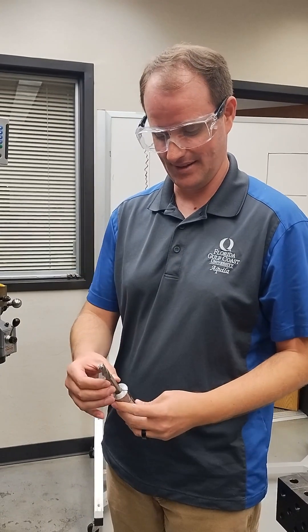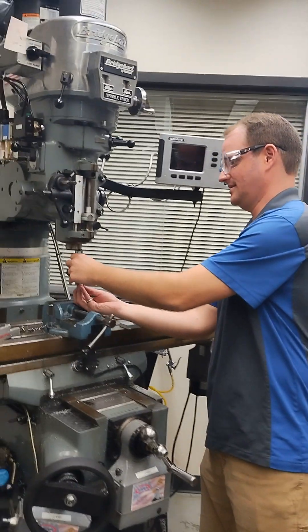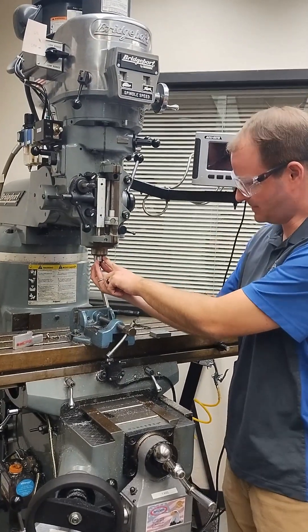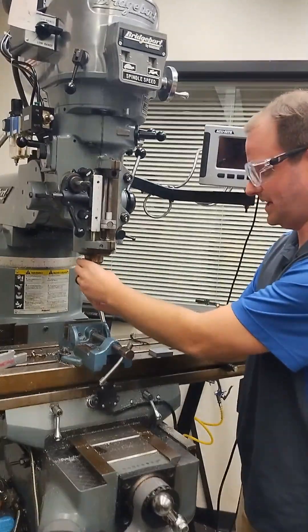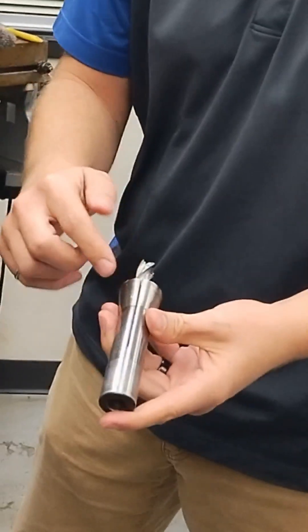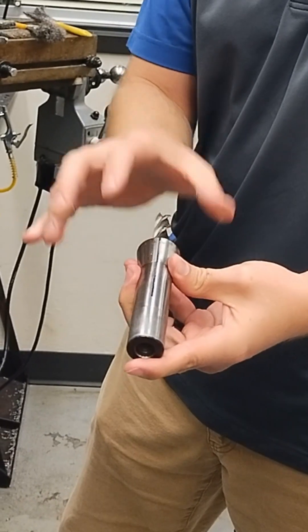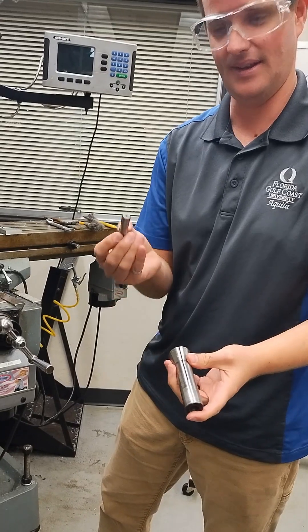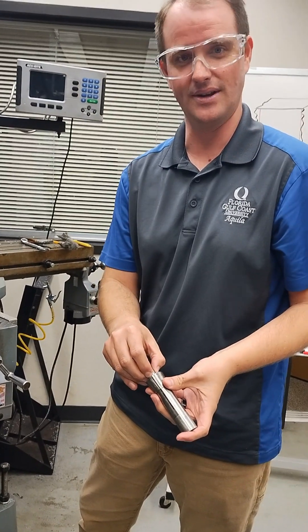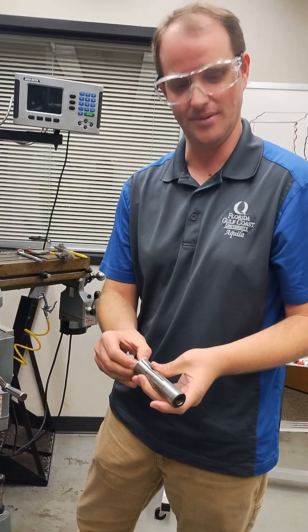This is sized to fit our milling bit, and then the whole collet goes into the end of the spindle, and then there's a thread inside the spindle which will pull this bit up into that. There's a little bit of a gap on the sides of the chuck, which will cause it to squeeze down onto that bit and hold it very, very centered — exactly, or very close to exactly, in the middle — as well as not allowing it to slip or rotate at all.